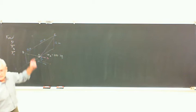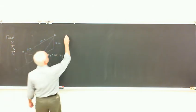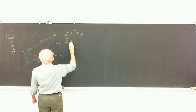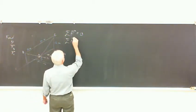So, what do we do? Free body diagram, sure. We can grab our free body diagram, anything we want. But why? You'll get some points for doing that, but if you don't do anything else, you won't get all the points. Sum the moments, the forces. Yeah, you want to sum the forces and sum the moments such that they're zero. It didn't specifically say that the bucket was in equilibrium. But in this class, you can darn well assume it is.